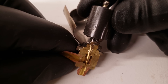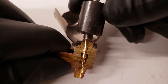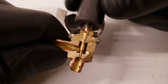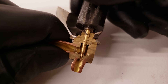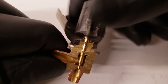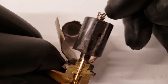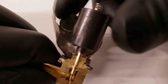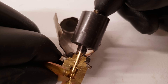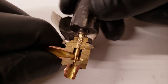Here we have the inside of the EEV. You see this magnet — you have a magnetic field surrounding the stainless steel shell. As the magnetic field is rotating, it screws this in, and that moves the needle, closing off the pathway down here. It's not closing it off completely because the needle gets larger and larger as it's pushed down, sealing off more and more of the area. Likewise, it can go counterclockwise — looking at the top, you unscrew it back out again. There's also a spring at the top so there's no way to back it out too much, because when it's time to close that pathway back down again, the spring presses inward, allowing this to catch onto the threads, and then it can start tightening down and closing off that pathway again.